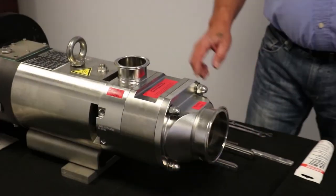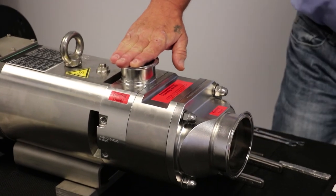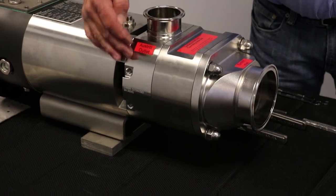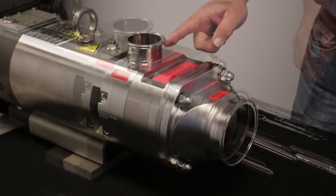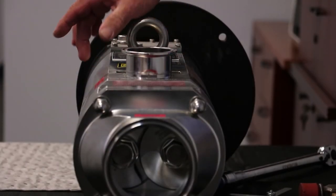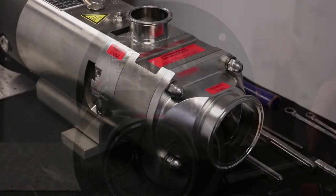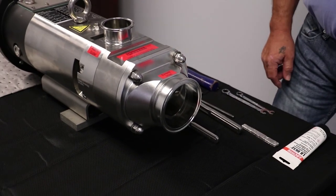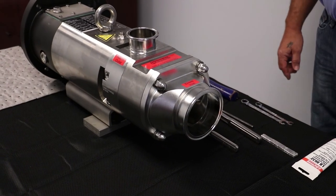In the wet end of the pump are three sections. First is the intermediate flange, where the mechanical seals, mechanical seal flush ports, and the suction or discharge connections are located. The next section is the pump casing, where the feed screws operate — this is the flow rate and pressure generating area. Last is the front cover, which holds the wet end together and provides either suction or discharge connection depending upon your flow direction.